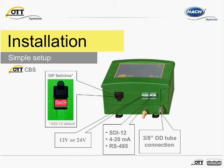If using SDI-12, the sensor's response includes more than just the water level that's been measured. It also includes air temperature and an error indicator or status message in the SDI-12 string. The CBS may be powered through the data logger or through an independent power supply.